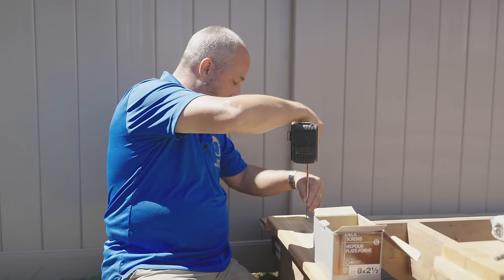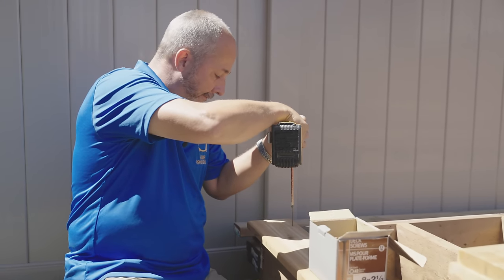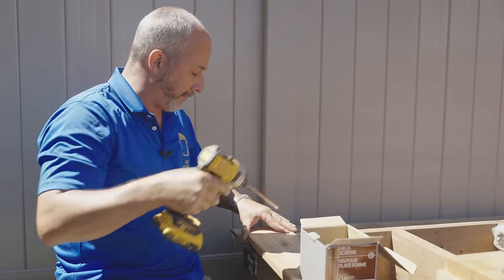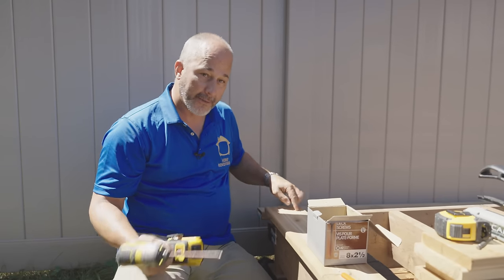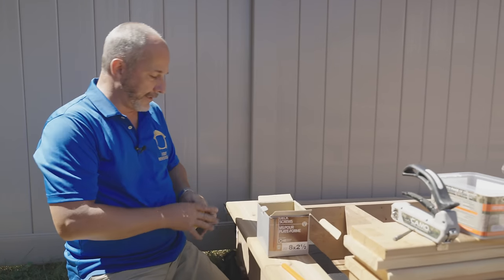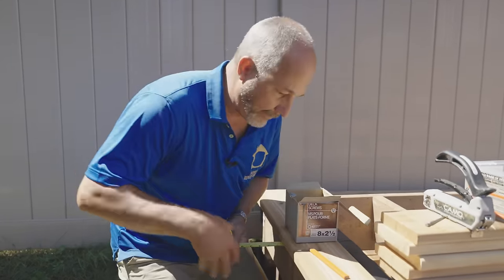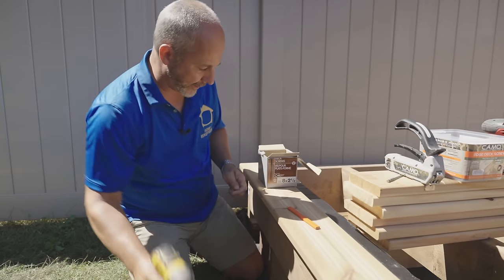We're going to come back a few inches, 3 or 4, 1 inch off the wood, 4 inches off here, in reverse, burn that a little bit, and go perfectly flush. Or maybe just a touch of a dent. You don't want it holding too much water. At the end of the day, this is the weakest spot on the deck. So how this one board performs is crucially important. Now what you want to do is you want to go every 16 inches, okay? You want to measure. Am I still at 1 3/4, right? And in this case, I'm not. I'm way up, okay? And you want to put that screw in every 16 inches.